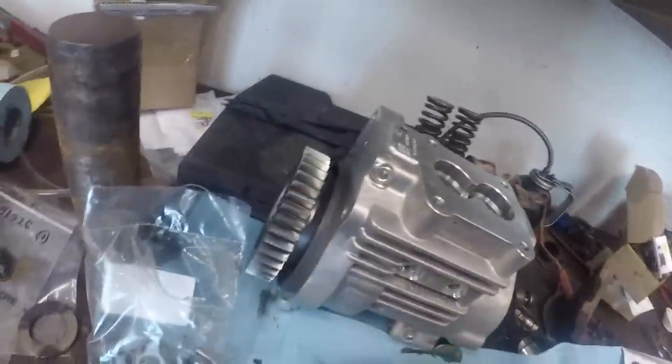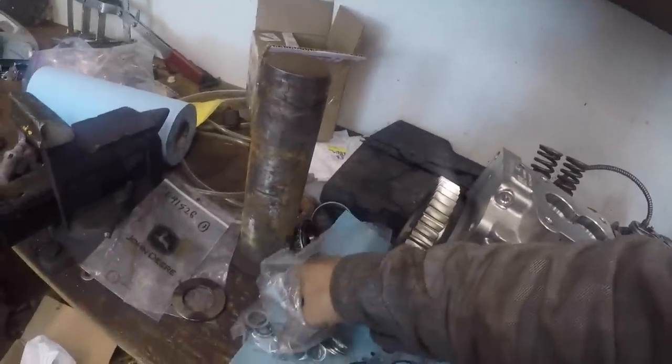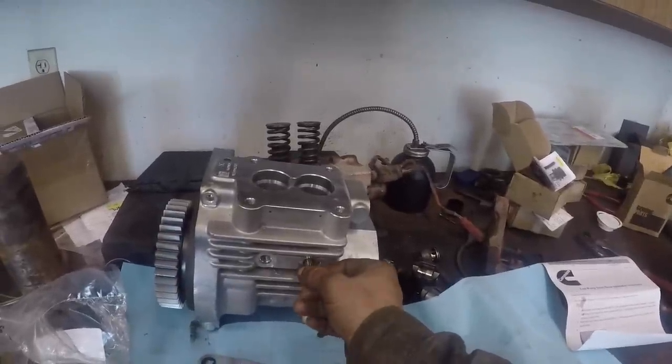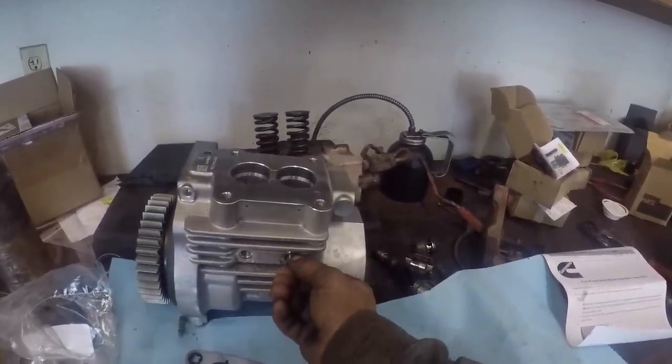There's our head gasket. And there is the O-ring that goes between the gear pump and the housing. Sealing washers, you always want to use new sealing washers. Okay, the guide pin. This slot's going to go up. Those will slide in the hole like so. And they've got a slot here with the screwdriver that you can turn them with.